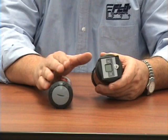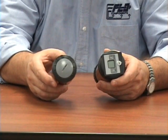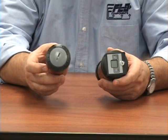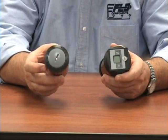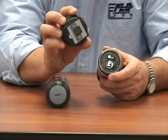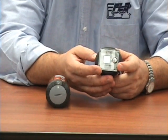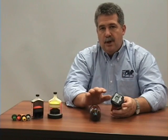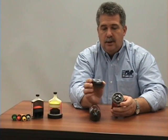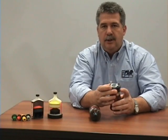One of the biggest issues with gas charge units can be the ambient temperature of the application they are functioning in — the ambient temperature dictates how fast or slow the gas will expand, which affects your overall dispense rate. This unit actually has a temperature compensation feature, so if the temperature changes below or above 68 degrees it can increase or decrease the expansion rate of the gas inside. Please keep in mind that all gas charge units are one-time use only. The exception is this unit: you use the controller for the next unit, get your replacement unit filled with the proper lubricant, clip it on, and start it again.